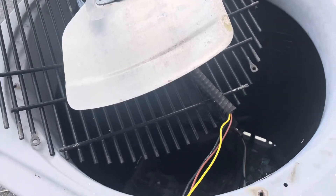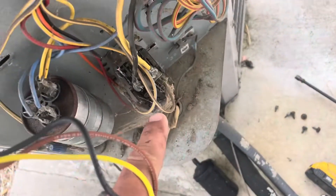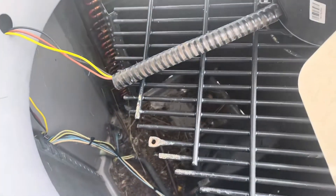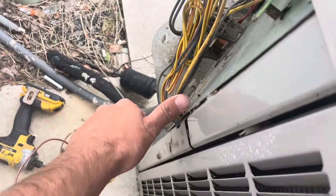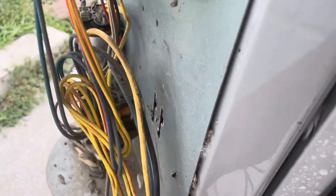What we're going to do here is leave the motor flipped upside down on top of the unit so we can fish our wires through the hole there. We're going to get our wires put through that hole, then through the hole that goes into the control panel, and get them hooked back up. We got them fished through with the motor still upside down, and then we're going to flip it back up, push our conduit through the hole and pull them in. Once we do that, we want to make sure we put a fastener on there — some sort of zip tie. Now we're flipped back over and in place. We're checking to make sure our blade is not going to hit our wires. It's very important to zip tie those back so those wires don't come loose and you risk your fan blade chopping into them. We're going to make sure we put a good amount of zip ties on them to keep them in place.